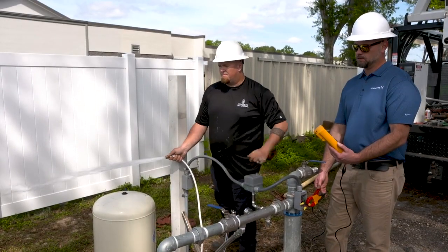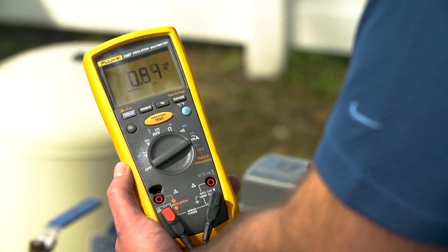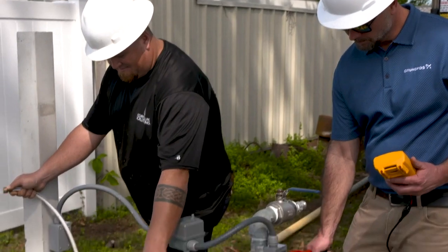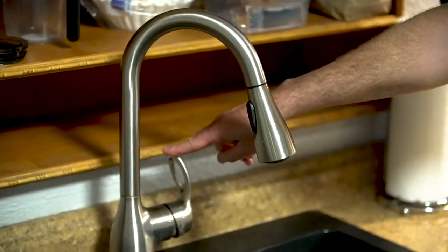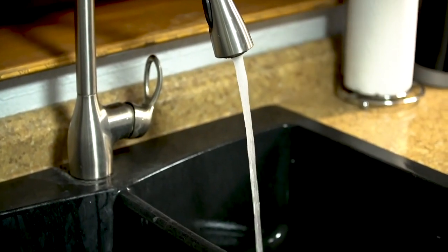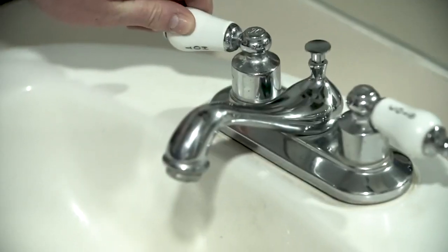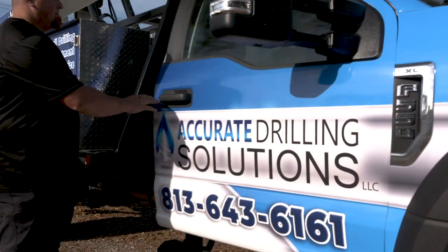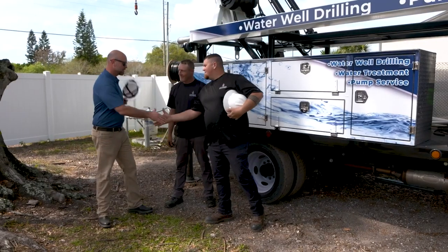Lastly, check the flow of the pump for any signs of trouble, including sediments or sudden flow rate drops. These could be signs of a problem with the well. Once installed, the Grundfos SQ is maintenance-free and reliable, delivering many built-in benefits and protections not available in a standard four-inch submersible. For more information on the Grundfos SQ, visit grundfos.us/sq.